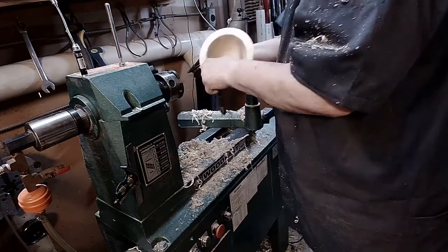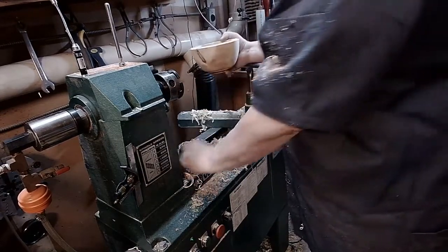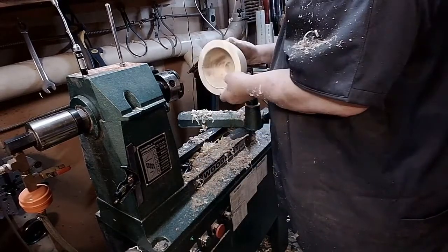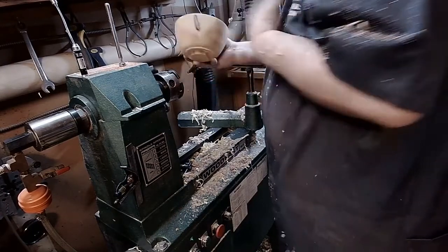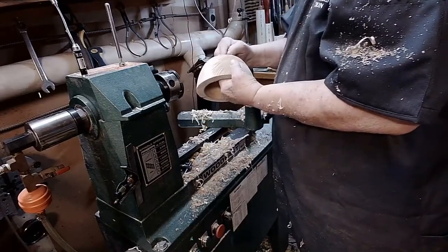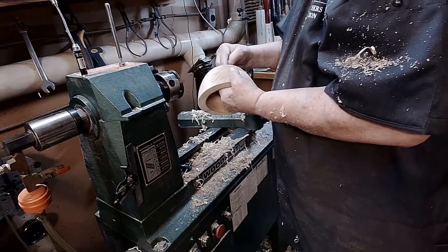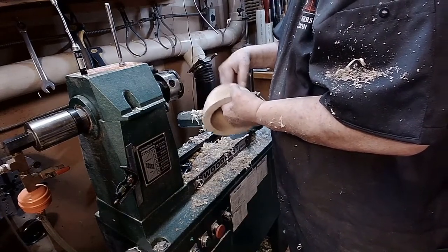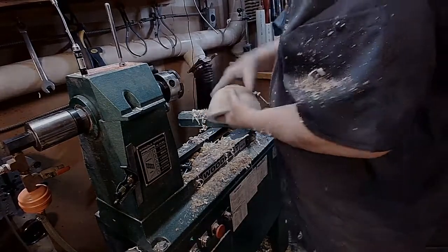and I'm going to seal all this surface, especially this end grain area, to allow the wood to dry more slowly. And I'm going to use an emulsified wax solution. It's an aqueous base, so if I get it on my clothes I can wash it off. And then I'm also going to write down here the date and the species of the wood. This is Bay Laurel, and I write the date down here also. So see you back over at the bench where I get out the sealer and the markers.